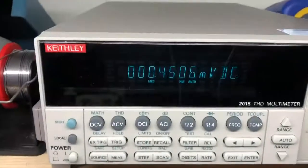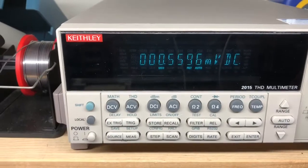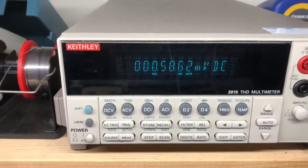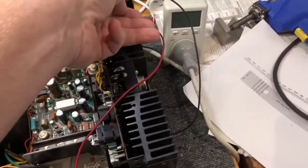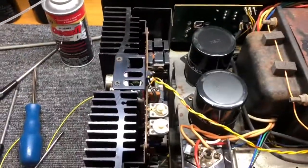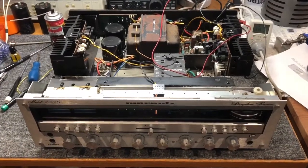What I've actually been doing here — as you'll see on the Keithley — is my DC symmetry adjustment. I'm adjusting the DC offset at the speaker terminals, and you can see we've got less than 1mV of DC, and that's the same on both channels. I've tested this over a period of time, set the bias current, made sure it's all come up to temperature, and then done these last final adjustments for the customer. Just a few more tests now, then the lid goes back on, and this beautiful Marantz 2330 will be going back to her very happy owner.